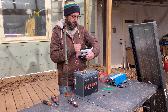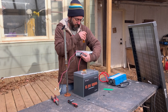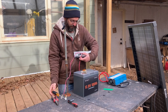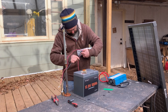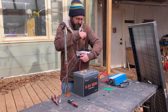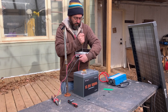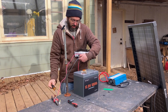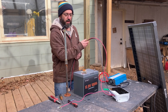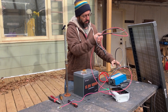We've got the PV, we've got the plus. Remember this is plus — slide it into that gate. Tighten it down just like the first one, give it a pull. Black goes to negative — same as the other one. Make it nice and snug, give it some pull. We are almost done. Now we are not going to hook these up to the solar panels yet — we're going to do that last. We want to hook the battery and charge controller up first.